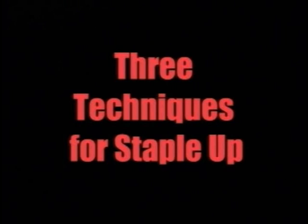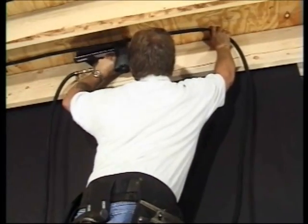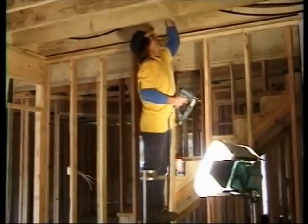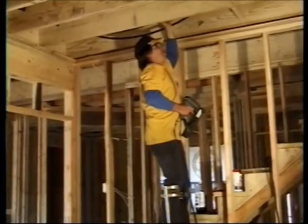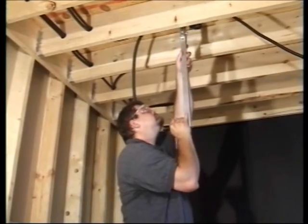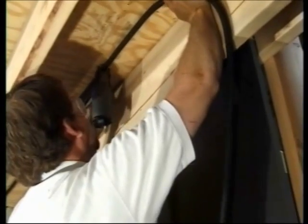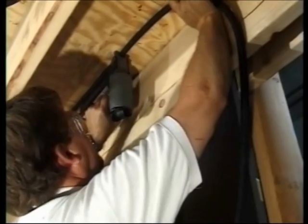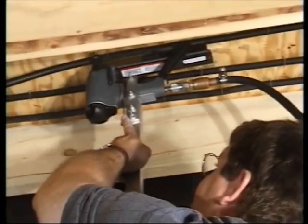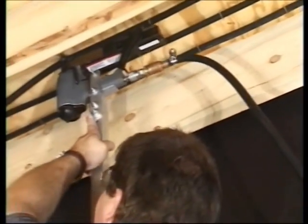Depending on the job site, there are three ways to staple up Onyx. You can place a ladder under the joist space and staple every six to eight inches. Some contractors use drywall stilts to reach the subfloor and to move quickly down each bay. Depending on the ceiling height, the fastest and easiest way to staple Onyx between joists is with the Watts radiant extension arm on a staple gun. When working overhead, push the stapler up tight against the tube and hold both ends of the stapler flat against the subfloor to get a good fit. In rooms with normal ceiling heights, the extension arm will speed up your installation.